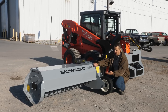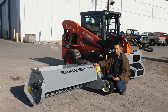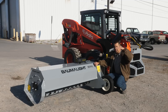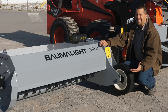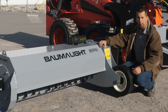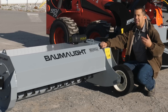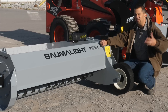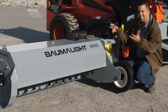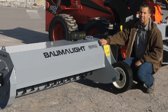We know from the past of running other flail mowers like this that they tend to give their best quality cut when they're really close to the ground — you can get almost a lawn-like finish out of a flail like this — but they tend to not work great at six or eight inches up in the air. Looking at the way this thing is assembled and the fact that it's on a skid steer hanging off the side, this is probably not that flail mower. Not something you want to go out and groom a pasture with, but more for maintaining the side of roadsides where you're going to have stickier material, heavier brush that you're really just trying to knock down.